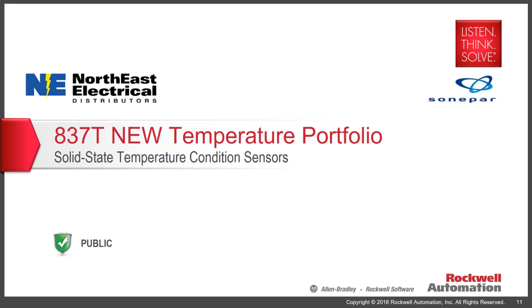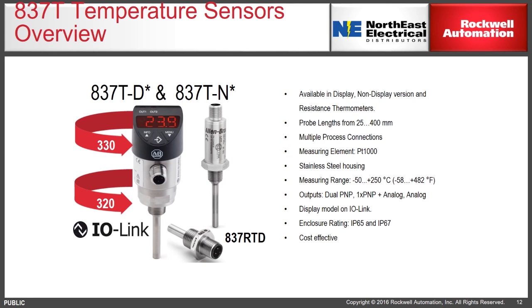The second type of condition sensor to be redesigned is the temperature switch or transducer portfolio. In this case, similar to what you saw in the pressure switches, there's a display version with a rotatable head and display. There's a non-display version, and a new member to the temperature sensing family for Allen Bradley is an RTD version that, rather than giving a 4 to 20 process out or discrete output, provides essentially a resistance RTD device, lower cost and typically more rugged. First, let's take a look at the non-display version.